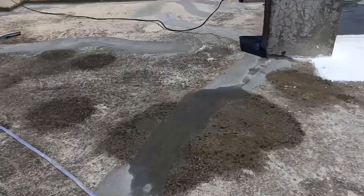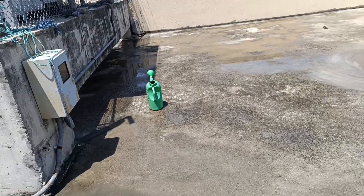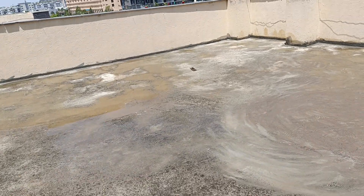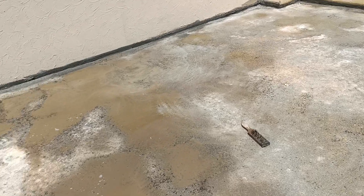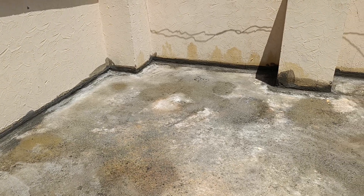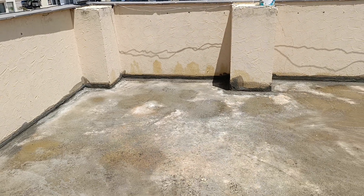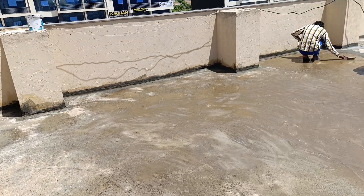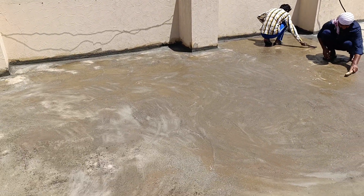This was the condition of the roof before washing it with acid. Now I will show you after — this particular area they have cleaned with wire brushes and acid. You can see the difference, which is clearly visible even in the video. With the naked eye it is even more visible. In this area they used the brushes but now they will use water — I will show you right now.